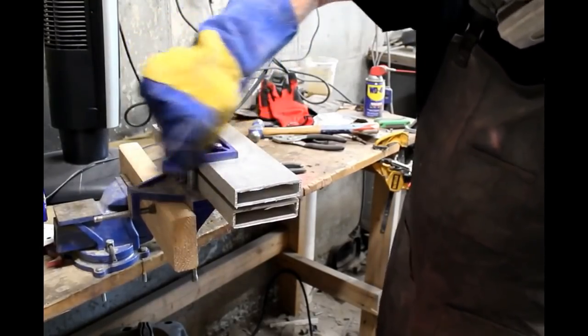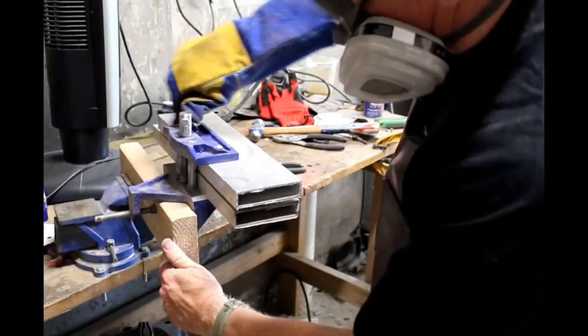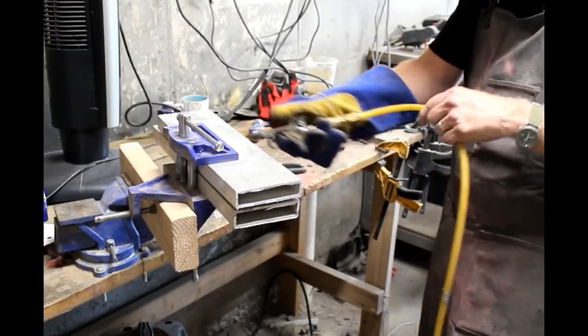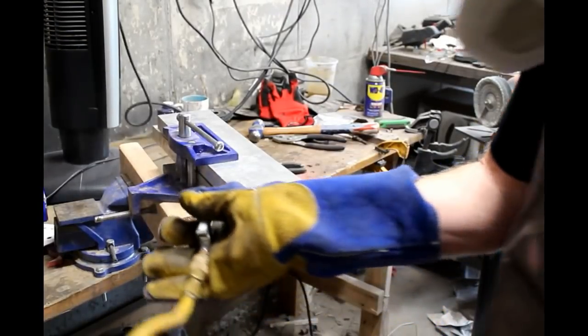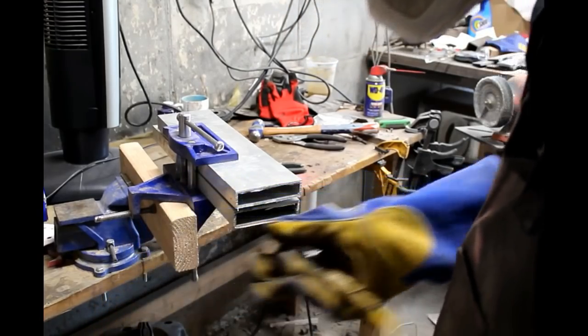You blow air around the knife, and because I'm using tubing, I can also blow air through the tubing to let it cool very quickly. I can basically plate quench two knives at a time with this setup, as long as they're both the same thickness material.